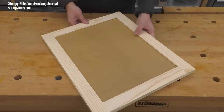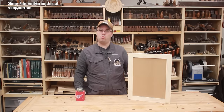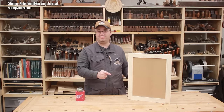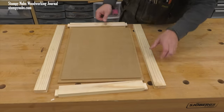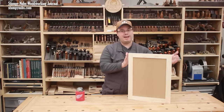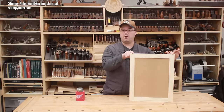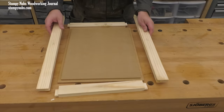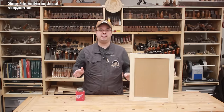Here's what we'll be making: a 16 by 20 flat-panel door with an MDF center panel, which makes the door very strong and stable and looks great when painted. If you don't want to paint, you could replace the MDF with a veneered plywood panel using the same techniques. The door is made up of horizontal rails and vertical stiles — rails run horizontally like the rails in a fence. The stiles overlap the ends of the rails because that looks better from the edge. The ends of the stiles are cut square, but the ends of the rails have tongues. The terms we'll use are rails, stiles, tongues, grooves, panel, and rabbets — all made with a table saw.